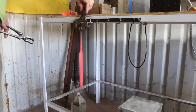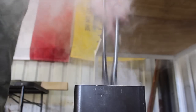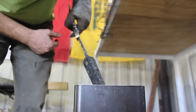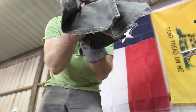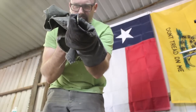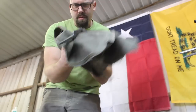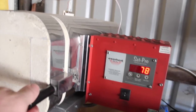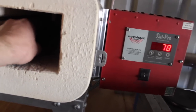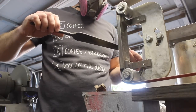If there are any warps or twists or bends I can't remedy during heat treat, that gives me the maximum amount of material to take off if need be. Into the quench — still no rough grinding, forged down to a thickness I like prior to heat treating. It came out nice and straight, just a little bit of a bend that is kind of addressed. If you pay attention to your forging, keep it even, do your normalizing and thermocycles, and use proper quenching technique, warping and twisting really should not be much of an issue.